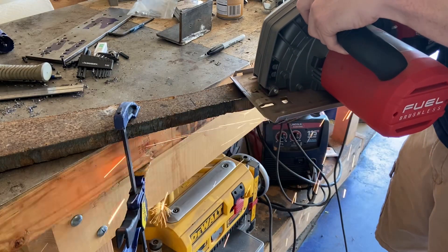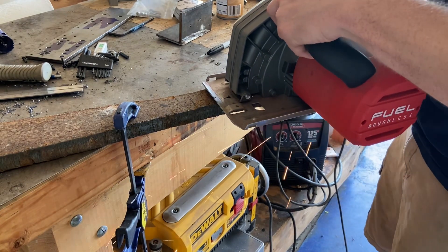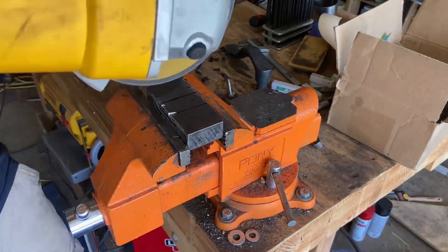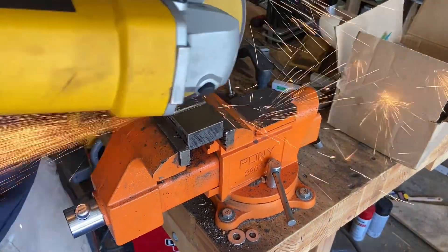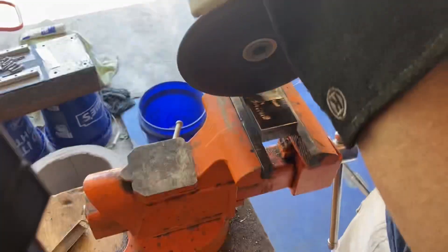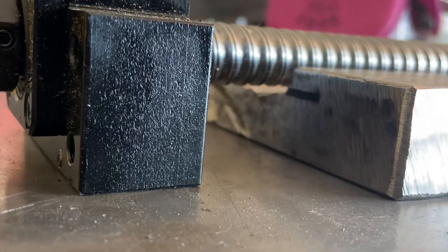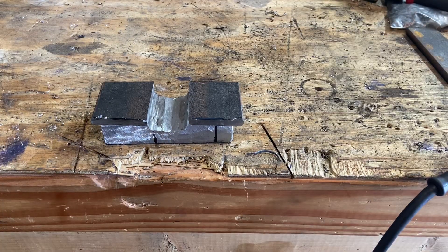With the grease fittings on, I moved right on and started working on the mount for the strong side of my main lead screw — the side that's actually taking the axial force. I made it out of a chunk of scrap steel, about 0.9 inch thick — maybe it was inch thick originally and just rusted down. I'm basically going to carve out a little indent with the angle grinder so the lead screw fits down the middle, and it's going to have bolt holes on both sides. You can see the lead screw fitting right in that little indent, and now I just need two little extra shims on the sides to shim it up just a little bit higher.